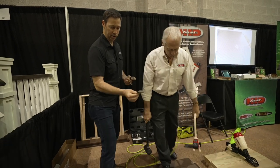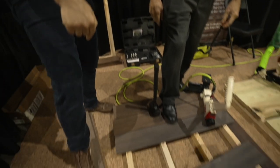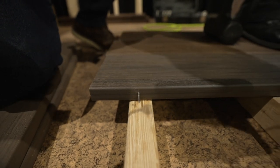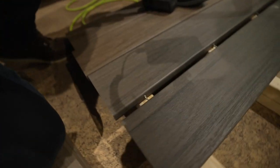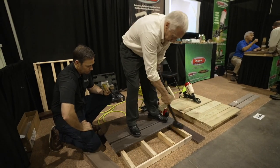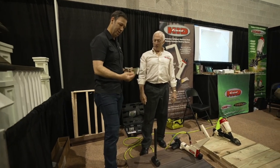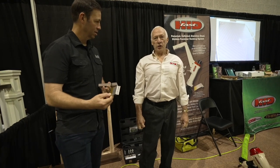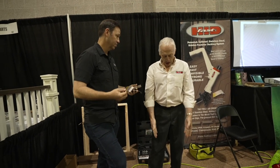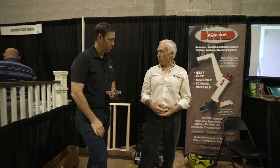Here's the collated nail that he just nailed in there, and this part right here is running on an angle like a flooring nailer would into the joist, but you're going to notice that there's a piece sticking out. That piece is going to pick up the back edge of your next piece. So we've got a composite board — this is Wolf PVC decking. This board could be 16 feet long or 20 feet long. You start on one end, hit here, walk down and keep hitting as you go. Once it hits the spacer bar, you've got an eighth-inch gap. We are the only collated hidden deck fastener on the market. It's totally hidden — a beautiful look, rock solid because we have a positive connection. We go through the board into the joist just like you would with a face screw or nail.